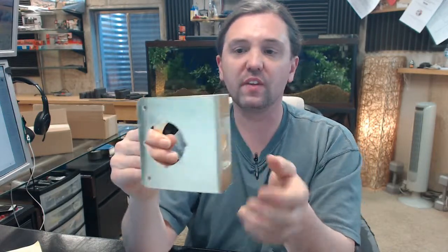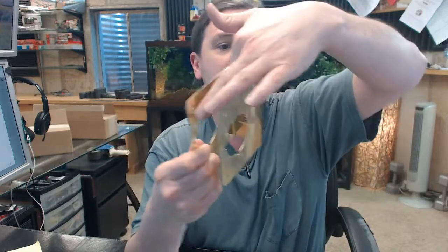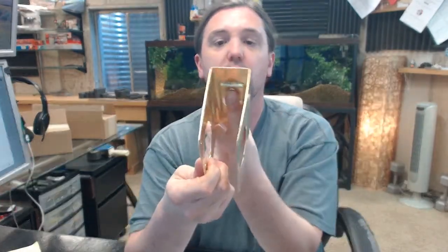When I've installed these, what you're going to find out most likely is that you'll have to clear out and chisel the back side of the door reinforcer to accommodate the plate. You're going to want to get the lock removed from the door, get this over the edge, and then begin to work the edge of the door so that you can get this attached as flush as possible down to the edge of the door.